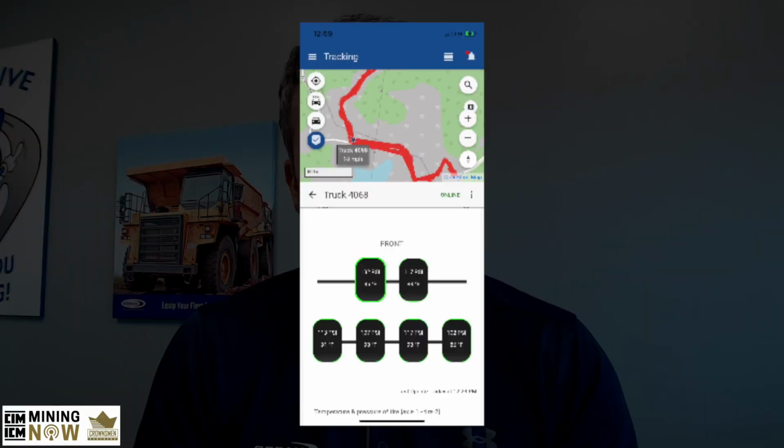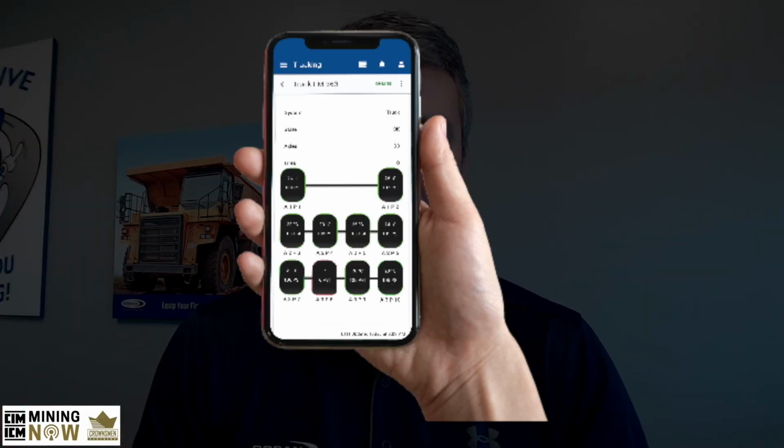So moving from the basic standalone system to the one-click, now we look at how we get that data off of the machines. Doran has the capability to tie into really any third-party telemetry or telematics provider through whatever data communication protocol they want, whether it's RS-232, J1939, CAN bus, Bluetooth, etc. We have our own proprietary solutions. One is called Doran CONNECT. Think of that as a cellular-based GPS fleet management type system.